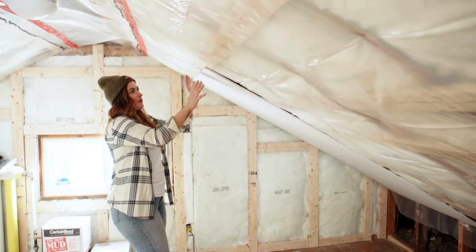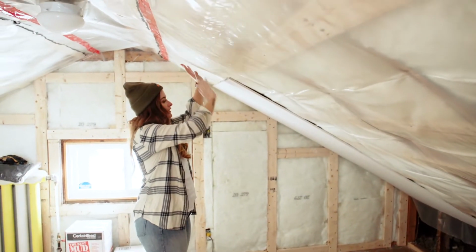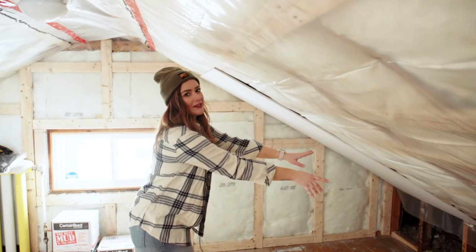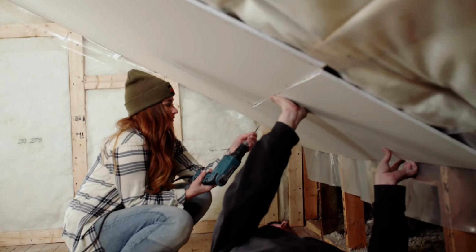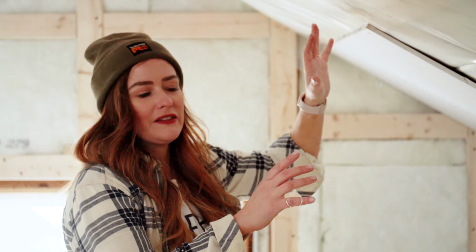We're gonna piece the drywall with a short piece here, long piece, and then we're gonna go short piece down low and a long piece up top and switch it all the way through. So you don't want your weak spots to be all in the same place. You wanna alter them and switch it up, just like you would when you're laying flooring. You don't want your flooring all to end at the same spot.